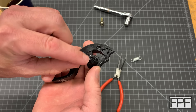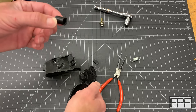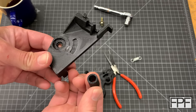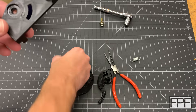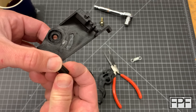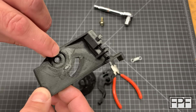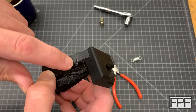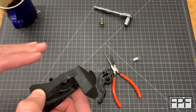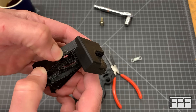These prongs here were actually broken before — there was only one remaining but it seemed pretty stable so I went with it. It looks like that didn't fail us, but I think this part is supposed to be attached. Yeah, this part was definitely attached here. It's a little difficult to see where it broke off, partly because there's grease on the part, but I can clearly see where this one broke off. You can see the white stress marks on the plastic. It looks like it broke off at a layer line, and I also notice a spot where I may have had a mistake in the original design — it looks like it was pushing up against the cutout for the steel reinforcing bar that runs underneath the seat. We probably do need to adjust the design a little bit in that spot.